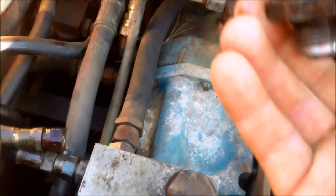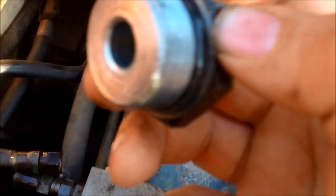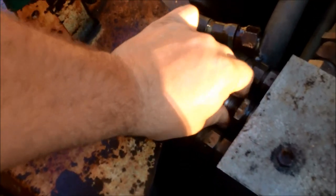The hard part on camera is to tighten this bung in. Again, look at your O-ring — it's still good, there's no cracks and it's not chunking off. But if it was bad, you need to replace it. This goes in here, get it threaded in there. If I can get the threads to start with one hand — yeah, I'm golden. You just tighten that down and you'll know. Then you reapply the hose and you should be good to go.